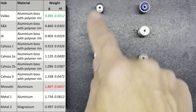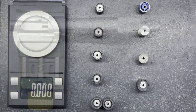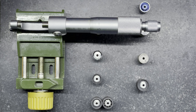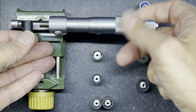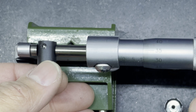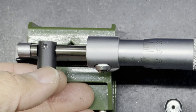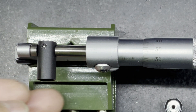It's also worth mentioning that none of these hubs have any grub screws in them — I've removed all the grub screws and they're just as they come. Next up we're going to measure them. To do that I've got my micrometer set up in my vice. I'm going to measure the diameter first on these polymer hubs, specifically where the aluminium boss inside meets the polymer hub, because otherwise the micrometer can tend to crush the polymer hub slightly.